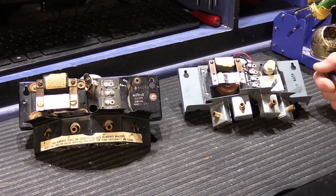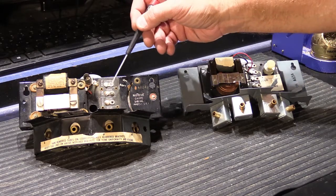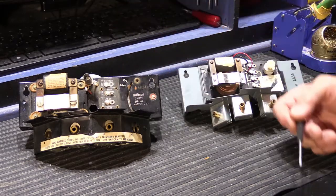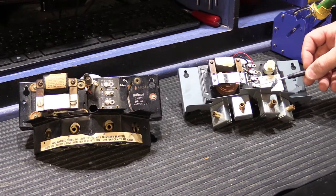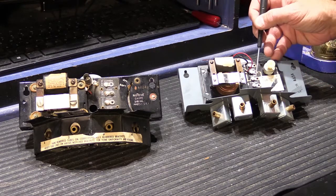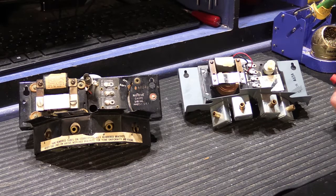The L model chimes introduced a third option: the side door button. So you have front, rear, and side. Front still rings your eight or four note Westminster chime, and then you have a single note for the side door and a different single note for the rear door, as the brochure pointed out. It's the first time you could have up to three doorbell buttons that would ring differently.